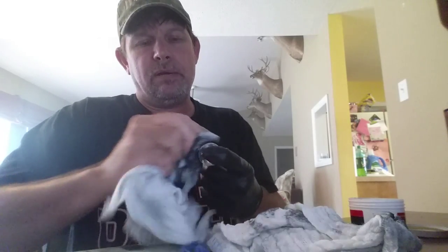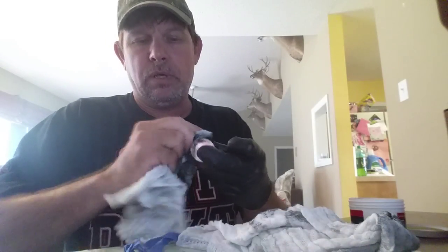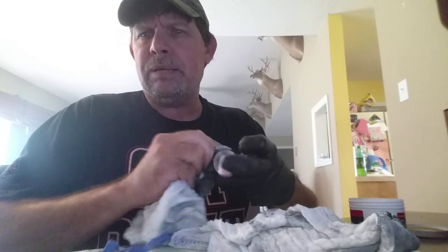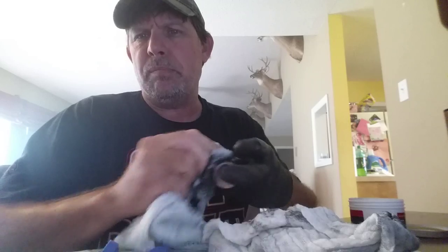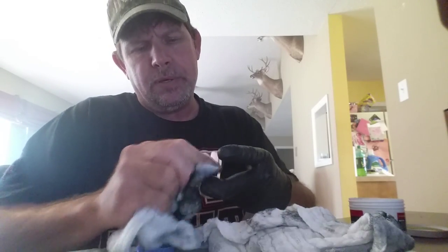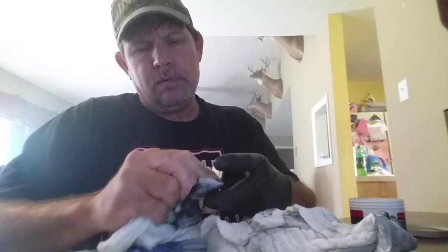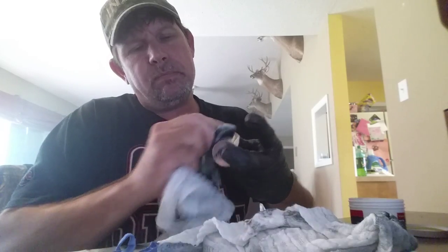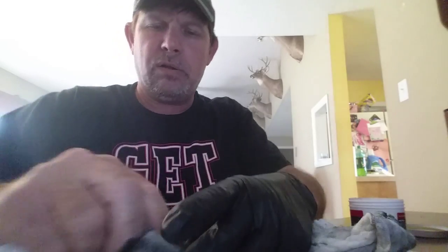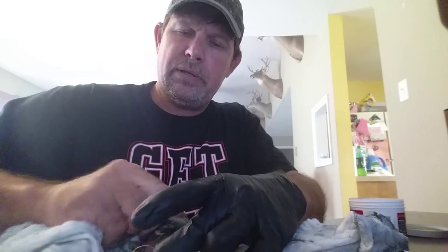I just rotate it around, taking it off. I guess you do wax on, wax off. Same thing. I used to use car wax after this process. Car wax keeps the oils from your hands from patinaing your mod so fast. It does copper a lot quicker than it does the brass. I just rub it, rub it, and rub it. Really nothing special. Just make sure you get all the polish off of it. Don't have to apply a whole lot of pressure to it.